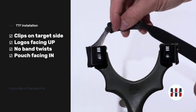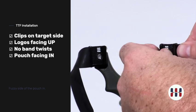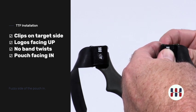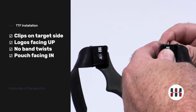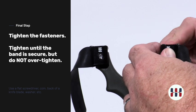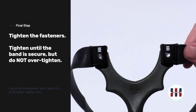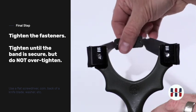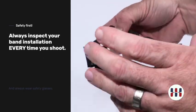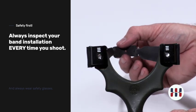This is now in place — inside of the pouch in. Place the band, get the flip clip in the groove, and tighten it down. You can use a screwdriver, the back of a pocket knife, or whatever you have handy. Just do not over-tighten. Tighten enough to clamp the band down securely. Always test your bands — give them a good stretch when pointed down. Make sure they're installed securely but not over-tightened.